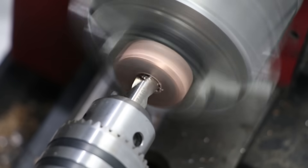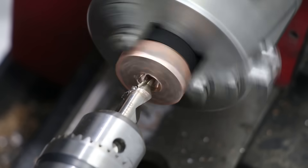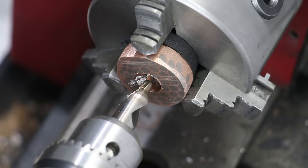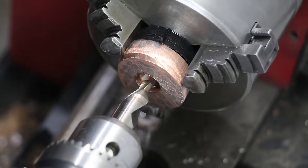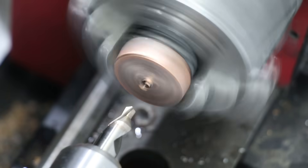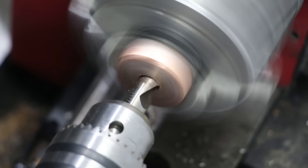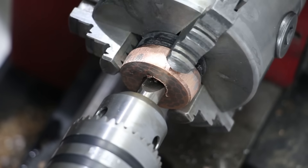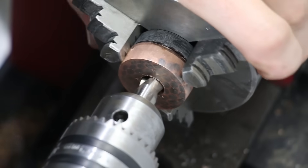That's not to say it's not still a very difficult process to cut through superconductor — it's actually really difficult. The titanium in the superconductor makes it really hard to machine, and the copper surrounding it is incredibly hard to work with. It work-hardens as you go, and it's also a really gummy material, so it's getting gummed up and also hardening and causing problems. You go through drill bits like crazy — I'm only going to get this one use out of this drill bit before I need to flip it around, and then probably one more use on another superconductor piece before it's garbage.